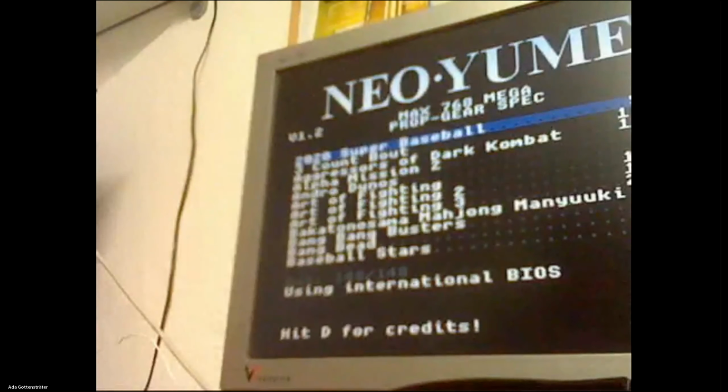But if you have a bitmap image, then you have all the data all the time that makes up the pixels. So if he has some abstract mode, he has to be able to convert the compact data into expanded pixel data in time to drive the video output so it can raster. Yeah, that's basically it.